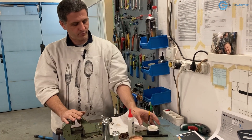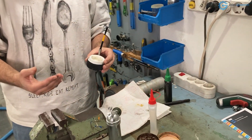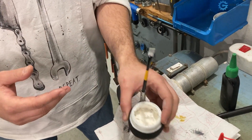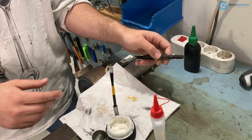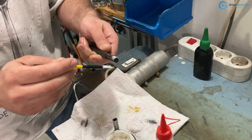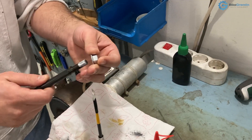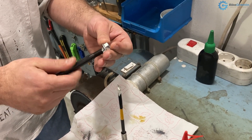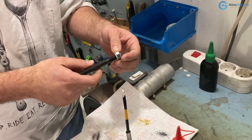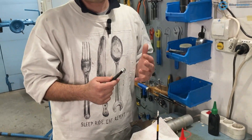Now about mounting pastes — what are mounting pastes? They are often called anti-seize pastes, but it's not the same; those are two separate properties. Mounting paste means it is used when you are mounting something to make sure that everything slides easily, so you can apply it to threads before screwing something on. Some — in fact many, but not all — mounting pastes also have the property of providing anti-seize protection.